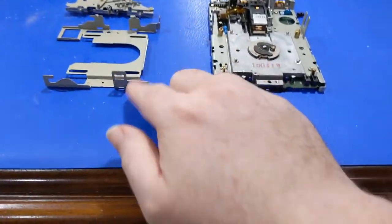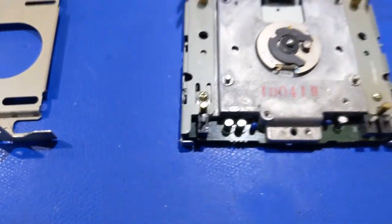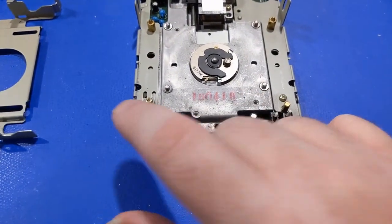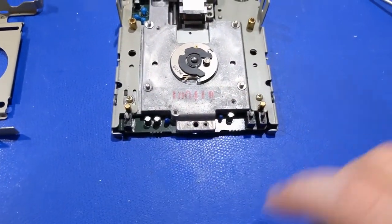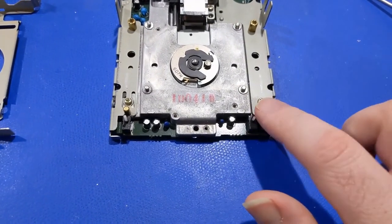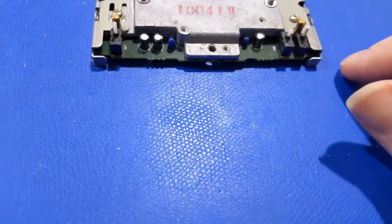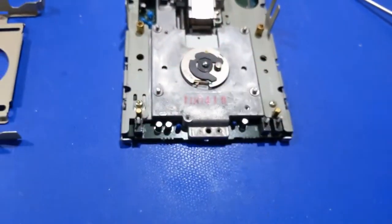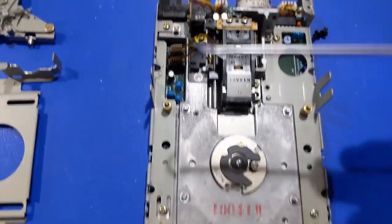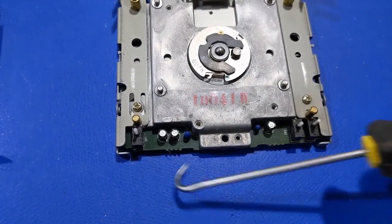After cleaning, I like to inspect the switches, because if any are broken or not working properly, the drive won't sense the disk, won't sense write-protect, and won't tell if it's double density or high density. It's worth spraying some DeOxit or contact cleaner into these switches. Also inspect the electrolytic capacitors on the drive board and make sure they're not leaking — you may want to just replace them, but watch the profile height.